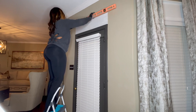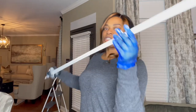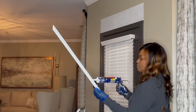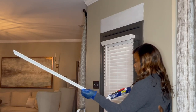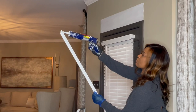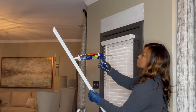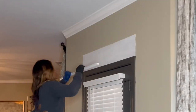This will determine how everything else that goes behind it sits — if that board is straight, everything else should be straight. Number five and six will be applying the inside trim. You can have this cut at Home Depot, but I decided to come home and cut it myself. Just be sure that your inside measurements are the same width as the plywood.